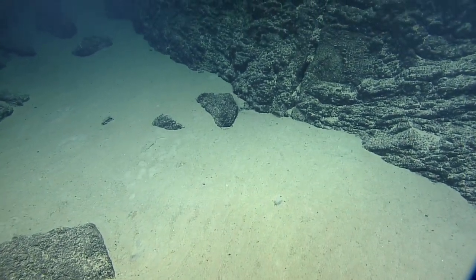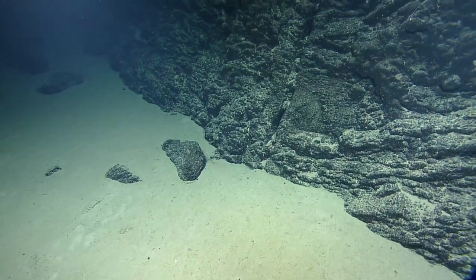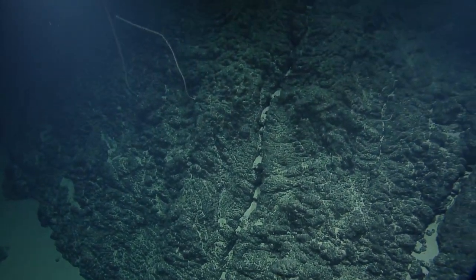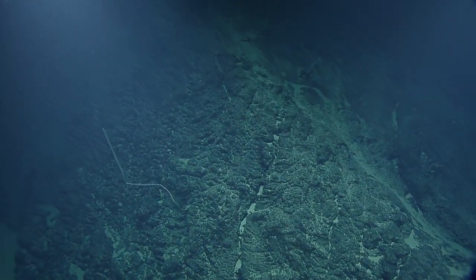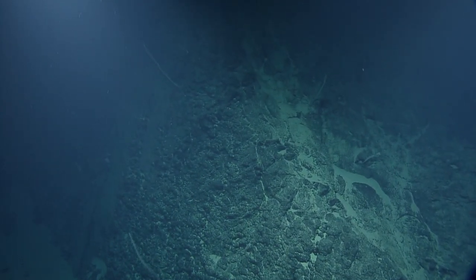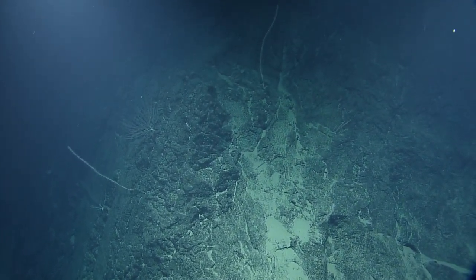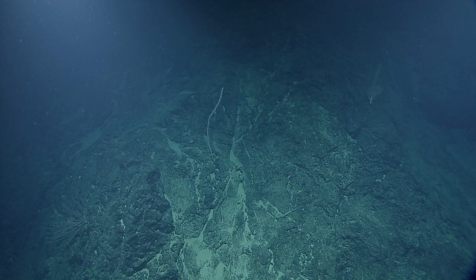Why does the camera feel so much smoother than it has in the past? It's because of the depth. The flow controls are set with a needle valve, which were brand new at the beginning of the year, and they're currently rusted shut because they are not meant for subsea use. So our flow control is set basically where we set that. We set that for our deepest dive so the camera moves nicely. But on deck, it's really fast. And at depth, with the increased pressure and the temperature change, the viscosity of the oil is more like syrup than it is on deck, where it's more like water, so everything moves slower at depth. Okay, gotcha.